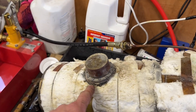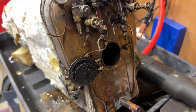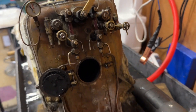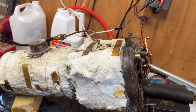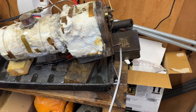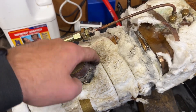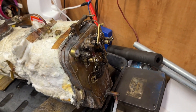We've got it pumped up, there's a little bit of pressure in there. We've got some weeps around the dome, and this left-hand steam valve is leaking quite badly, but pretty much that's about it. I need to sort this steam valve out and I'll have a look up inside the firebox as well. I turned it over and looked inside the firebox and it is all bone dry in there, so my only concerns are the dome gasket and the steam valve on this left-hand side.